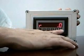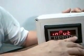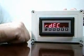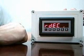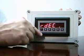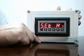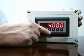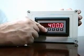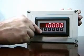The next menu group is where the actual span of the 4 to 20 milliamp will be set, as well as other variables. I'm going to go into the menus until I get to this one menu group called setup. You'll notice that there's a place for a decimal point location — it's asking for the rate decimal location to be used in this application, and we have a position of one being shown. This is then used in the set high parameter, which is the full scale value of the 4 to 20 milliamps. I can set the flow rate to the maximum I expect for this flow meter. To set it to a maximum flow rate of 1000, I just toggle through the digits in the various locations until I see the desired full scale, then press enter.